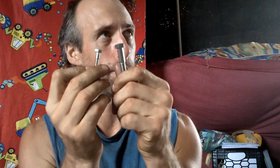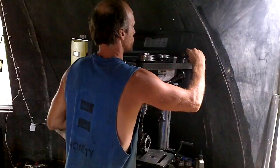So far I've been doing everything with 1/4 inch bolts. But this part is going to be direct to the wheels. There's not going to be any more gear reduction after this part. So it'll have a lot of force on it, and the bolt is going to have to bridge a little bit of empty space. So I think I'm going to put 3/8 bolts in this part. I think I have just enough space, as long as I don't screw anything up.